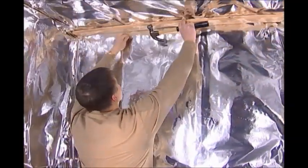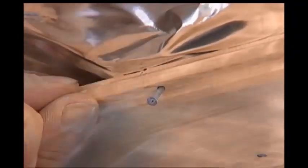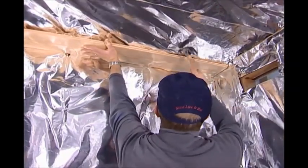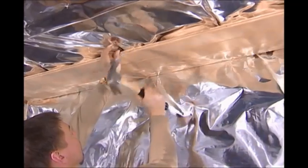Using ceiling boards marked with one dot, install the first board on the ceiling joists with the smooth side facing out and the groove facing the wall. The first ceiling board can be face nailed at the edges, as the 3/4-inch wide ceiling molding will cover these holes. Attach the board using the five-penny nails provided. Position the nail at a 45-degree angle where the base of the tongue meets the board, and nail to each ceiling joist. Countersink each nail using a nail punch. Install the second ceiling board by lightly tapping it into place with a hammer. Use a small wooden block to make the board fit snugly with no gaps. Each board will cover the nail holes from the previous board. Install the remainder of the ceiling boards.